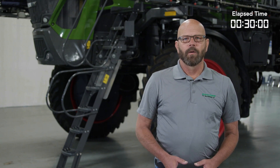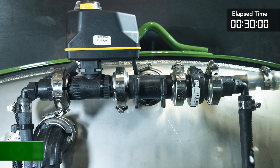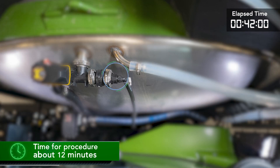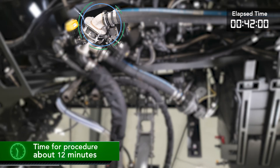There are five parts to the liquid system plumbing that need to be removed to allow the liquid system to be lifted off the chassis. Lock-off plates will be added to the lines that are removed to keep the inside of the liquid system clean. First is the front reload recovery line, located behind the cab — disconnect it from the tank, cut away any attaching ties, and secure it underneath the front reload line. Second is the front reload to sump — disconnect and cap the line. The front reload line will remain on the chassis so we'll secure it off to the side.